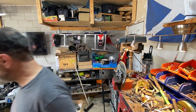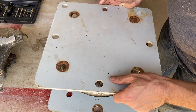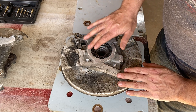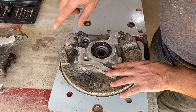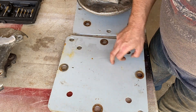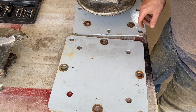I have to say, I've got a much greater appreciation for aluminum now - this stuff's really strong. Next step is to cut this to shape and then it'll go there, bolt holes, big hole in the center. The easiest way to do that is just to get a bit of light card and basically imprint the big hole and the little holes. I'm going to use my plasma cutter to cut the big hole and possibly around the outside, but the main thing is cutting the center hole and then drilling the holes for the hub itself to screw into.